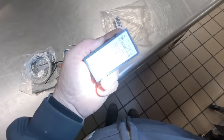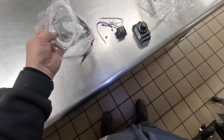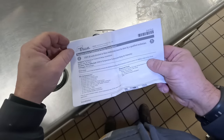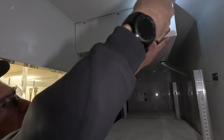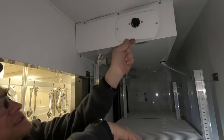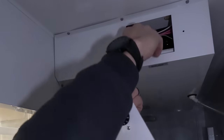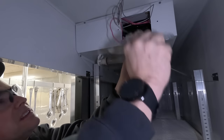This is rated for 75 to 240 volts. The black sensor goes in the air path, the white one goes in the coil. This has to be done by a qualified technician. Down here is our power plug — it's 120 volts, so we're good on that. It's not been touched or molested by other people, so no reason to deal with the refrigerant if we don't need to. We're going to go ahead and drop this down. The temperature control looks like it's connected in there to the coil, but it's not very well connected — you can see half of it's out here. We're just going to change it. I'm not taking a chance on a callback. It looks like it may be the original one, and they hooked putty back around the tube as you're supposed to.